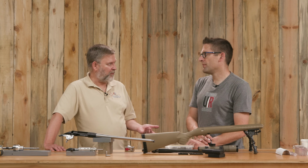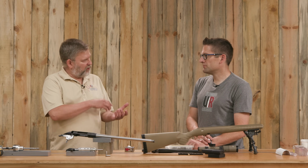If it were to pick up a burr or a chip or something and weld that, it would probably tear a strip out of your rifling. And so that's another reason to keep it going slow. The lube will keep that from happening if you're paying attention. It's all about using your brain, having some feel for things, understanding how the tool cuts. So when we lean into it a little bit, we get a chip load. You can see a nice clean chip coming off.